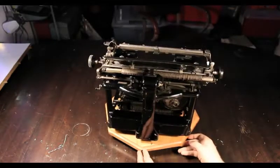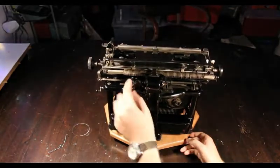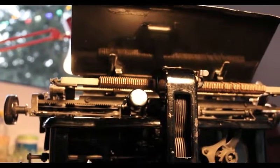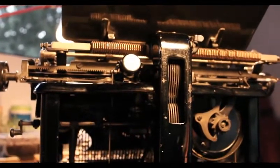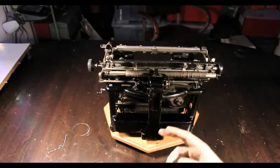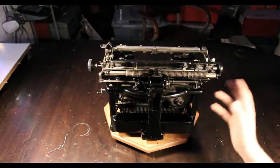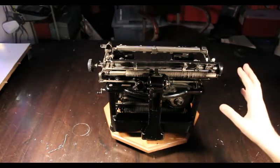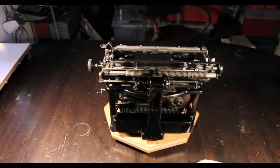And then here on the back, inside this drum here, which is a little bit hard to see, but again, I'll clip something in, there's beads. And the beads create a ballast for the carriage when you are tabulating, so the carriage doesn't all of a sudden jump over to the side. It will gradually move over, and it reduces wear and tear on the mechanism.